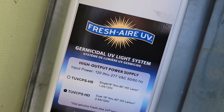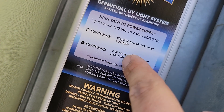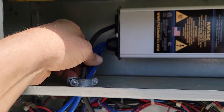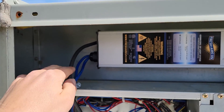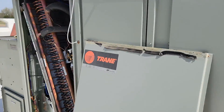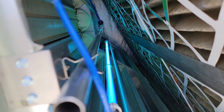There's an off and on switch, which I thought was really cool. Fresh Air UV Germicidal UV light system — we got this model right here and it is a 120-volt power supply. These are the two wires that go to the two bulbs. There are quick connectors and then there's some SJ cord here for the power supply that feeds these two UV lights.